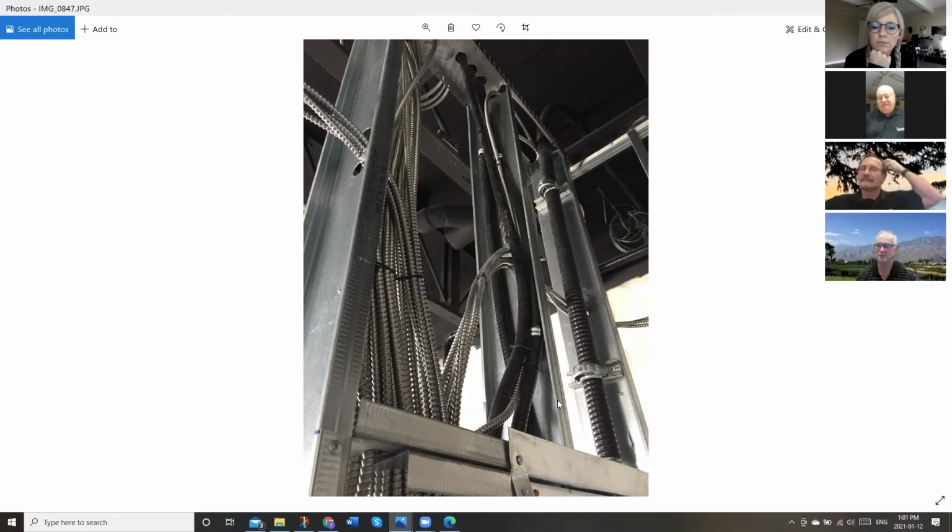Yeah. All right. So all you electricians out there, keep it in mind when you're doing steel stud work, you really don't want to run your armored cables inside the space created by the steel stud. Try and keep it on the outside. If you must, put some strapping on so that it's going to provide the clearance that we need, meet that 32 millimeters. And I think we've got this one wrapped up pretty good. Aaron, can I hand it back to you and take this home?